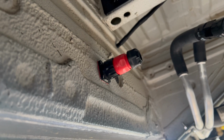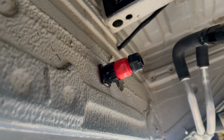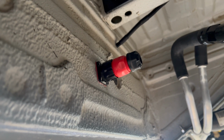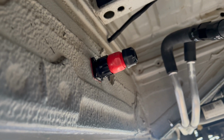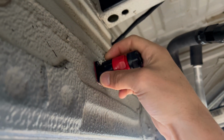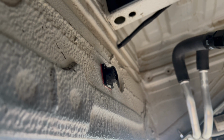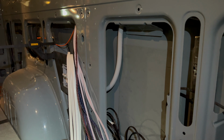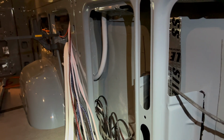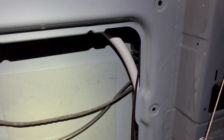For the actual plug end, I'm going to wait to wire this up for a minute because I'm working on the L-track mounting that needs to come down through the floor here, but this will be wired into the 120 volt AC leads on the IsoTemp water heater. This plug allows me to unplug and pull the water heater out easily if I ever need to service or replace it.